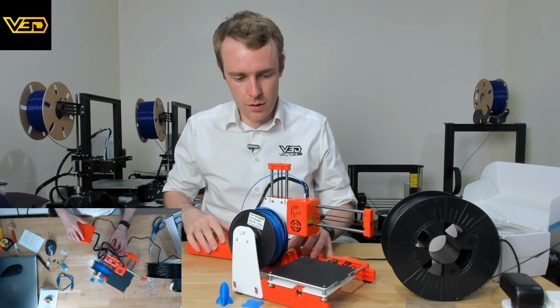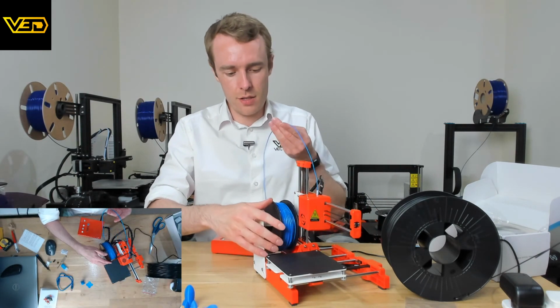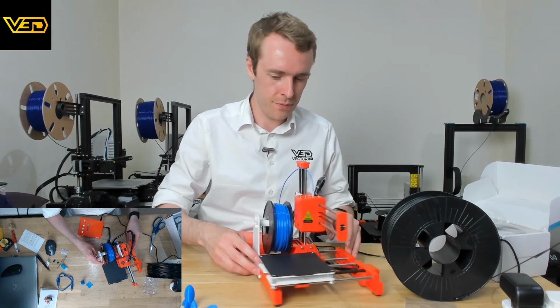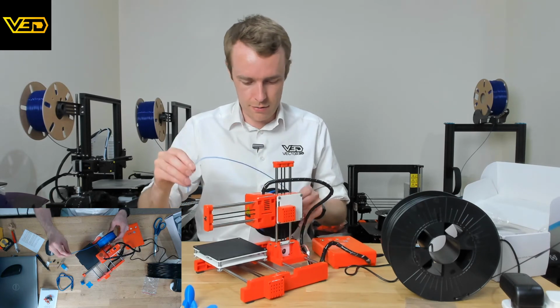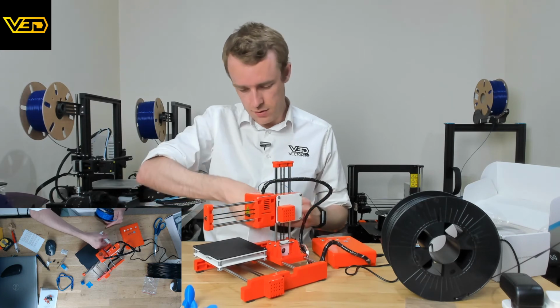Yeah, I think 180 does seem very low. I'm assuming that it's a heating limitation. Remember, they've only got 30 watts to power the entire printer. An E3D V6 standard heater on its own is 30 watts. And that's the filament out. So that unloads pretty... oh, this stupid filament.